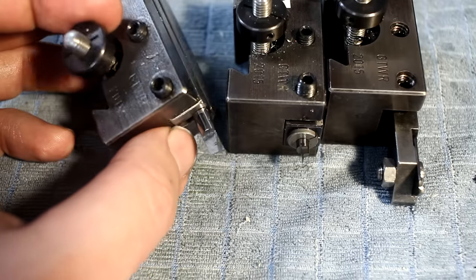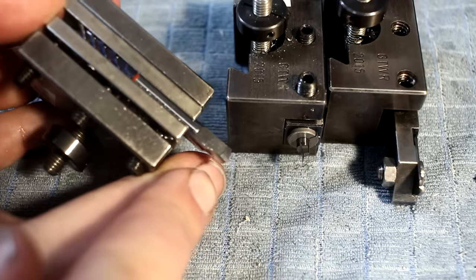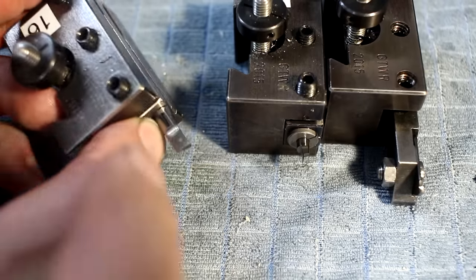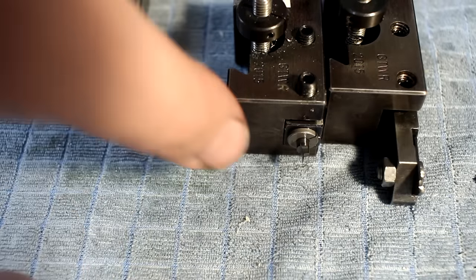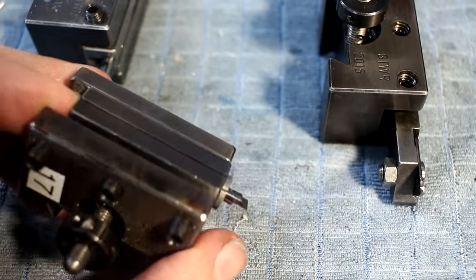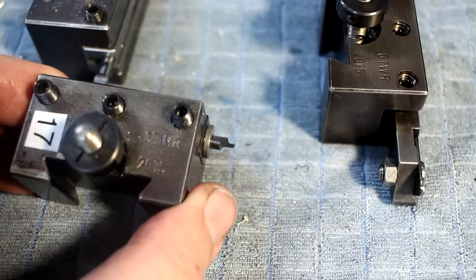Here are the other tools I'm using. This is the solid carbide turning tool. It has a nice chip breaker ground into it and is diamond lapped on every surface, and it has a tiny radius on it. Works beautifully. It was an old hard milling end mill, very good carbide quality. The 0.4 millimeter wide grooving tool, also ground out of an old end mill. As I said, old end mills are usually excellent carbide quality, nice fine grain, can be ground very sharp.